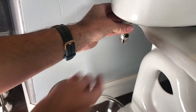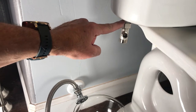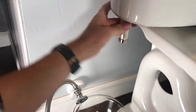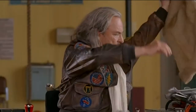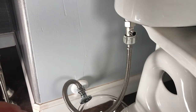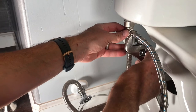Now I'm going to put on this connector piece. You need to be really careful when you're attaching something metal to something plastic — this is a plastic PVC connection coming out of the toilet tank. It can cross-thread really easily, so I want to start it very slowly, make sure it's going on straight, and then begin to tighten it. When I've hand tightened it and can't tighten it anymore, I'll go ahead and move on to the crescent wrench. Then I'll apply this back again hand-tightened, add some more Teflon tape, and finish tightening with the crescent wrench.